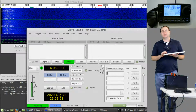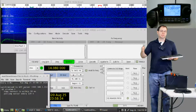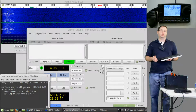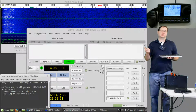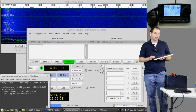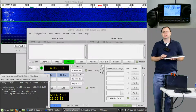software. And I do have in the background, for FT4 and FT8, having a good time synchronization is very important because it uses time slots to send the tones, and that way it knows when to expect which pieces of the signal, so it has a better chance of decoding things. Even down below the noise floor, it can sometimes decode. So in my case, I actually have a GPS receiver that's running time synchronization on my home network here. For Field Day, I was using the internet time source, but it works the same way. I'm using NTPD, and ntpstat is telling me it's within like 28 milliseconds. It's very, very tight time.